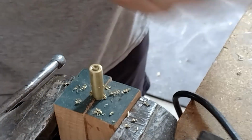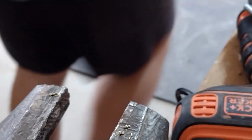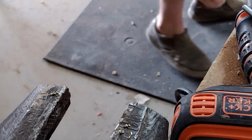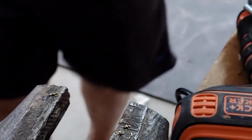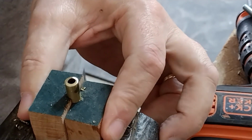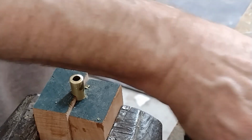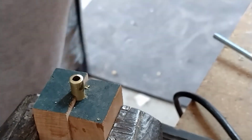After tapping the sides of the lugs, I need to tap the ends. This will be a 12-24 hole pattern, different pattern than on the sides. 12-24 is what drum tension rods use. To those of you who watched my previous video on making some lugs, I use the same jig to hold the brass rod in place.